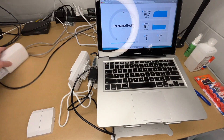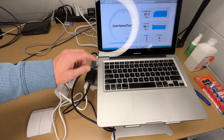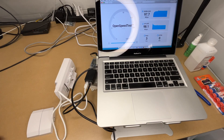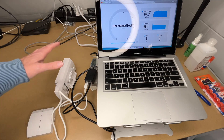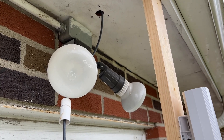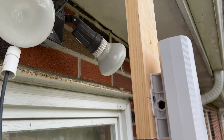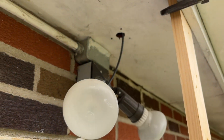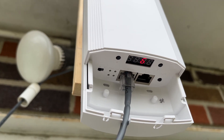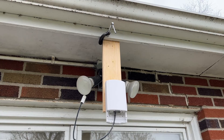So if this were connected to a house and the slave connected to a shed, barn, or garage the same way with a laptop plugged in, you'd be able to access the internet over this wireless bridge. I wanted to go over the indoor setup quickly, and now I'm going to do a similar setup outside to test it in the real world. I have a test board clamped to the fascia outside with screws, and I've used a wire normally connected to a security camera, plugging it into the unit — and inside the house that's connected to the POE injector and my switch.